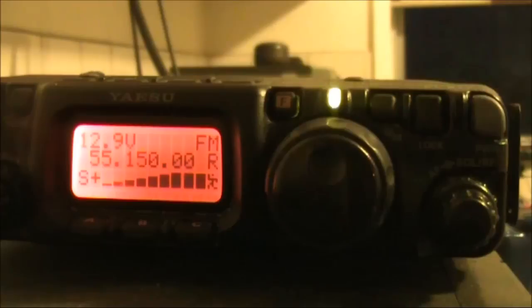This particular rig is a cut above the 27MHz AM walkie-talkies. It was a bit more expensive, but it's 55MHz FM, which should provide much clearer reception and also much less interference. Because apart from these walkie-talkies, there's very little at 55MHz. Whereas on 27MHz, you'd be sharing the frequency with CB on nearby channels, and especially with a super regenerative receiver, the selectivity won't be all that good.